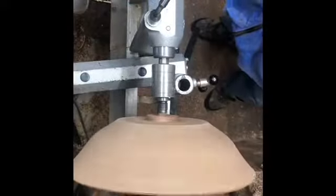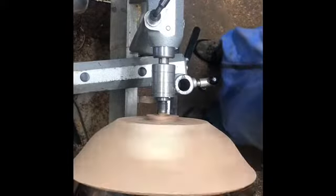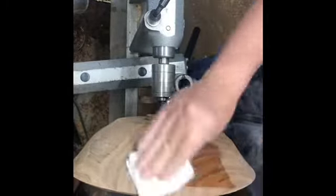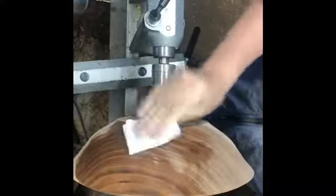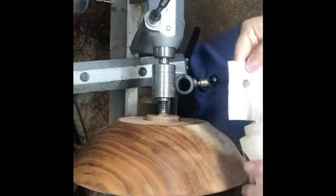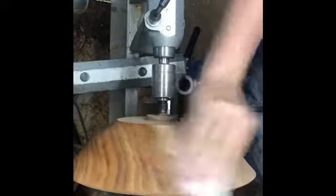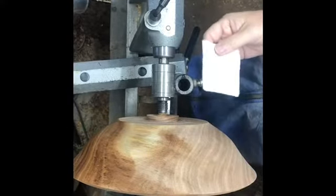We have sanded to 320 grit, which is my norm. If you want to see all of that, you can go over to my video. Smoothing out the rough spots, I believe is the name of it. What I am applying here is some sanding sealer, some diluted sanding sealer. This is the Deft brand. Lacquer sanding sealer that I have mixed 50-50 with lacquer thinner.